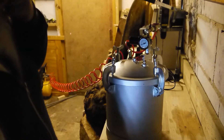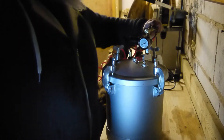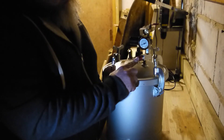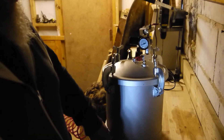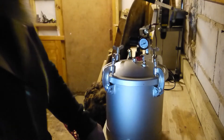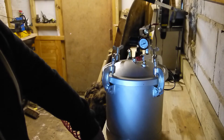I might change the blow-off valve if I'm getting bubbles, but other than that I think I'm alright. It's set to around 40 because it's starting to let a little bit of air out. I'll stop there — it's sitting at 35 to 37 PSI — and that's pretty much it. That'll work fine for your alumilite.